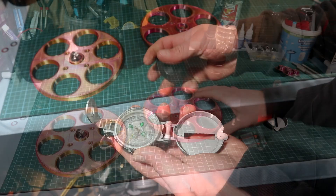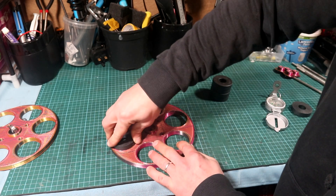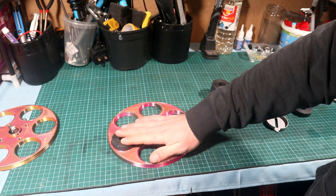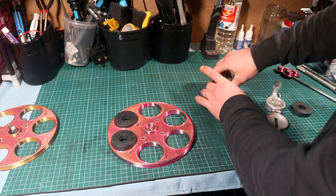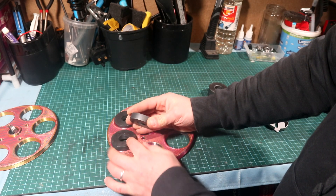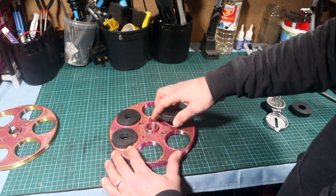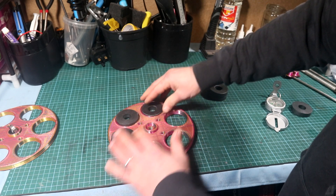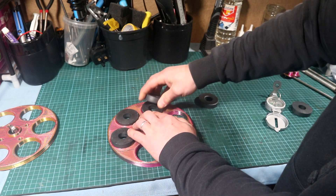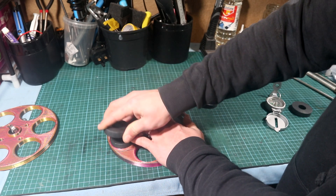When inserting the magnets I found a simple method: I insert a magnet partially by hand, give it a slight encouragement to go into the hole, then place the second one. I check — this side is repelling, so two north faces are against each other. Moving to the second one, it's attracting. The pattern must alternate: one repelling, one attracting. I get the fourth one, check it — it's attracting, so I flip it. Repelling, attracting — correct.